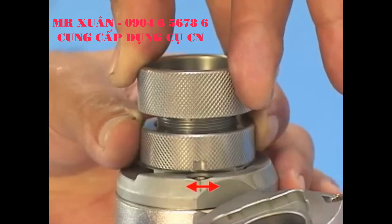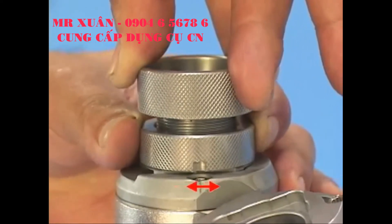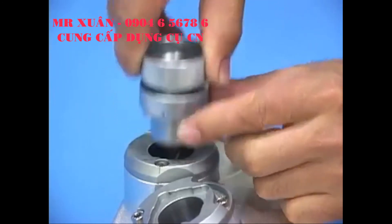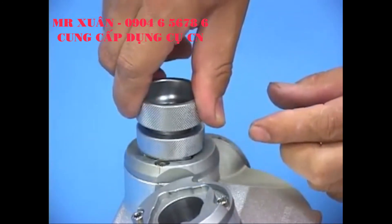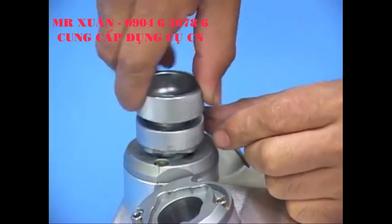Move the lower part to both sides with another hand to sharpen until the grinding noise disappears. Take out the holder with the end mill and change to another flute. Repeat the above steps until the sharpening for all flutes and gashes is complete.